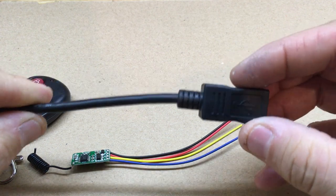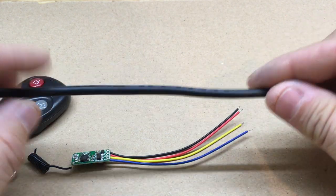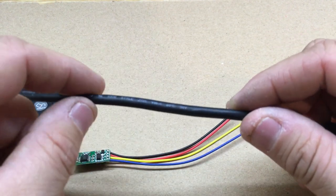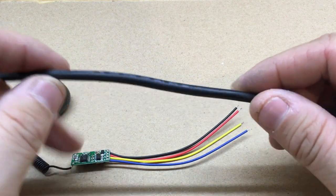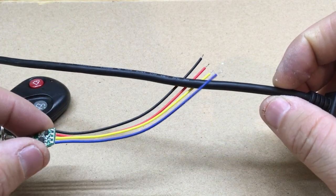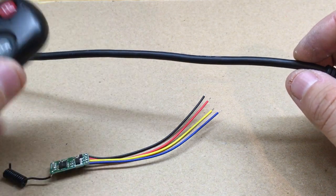What I'm going to do is take a USB cable I already have out there and cut it open a little bit. I'll keep the data wires hooked up but get in there and get the power and ground so I can tie them into this remote and just turn it on and off that way.